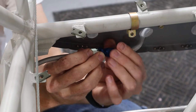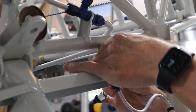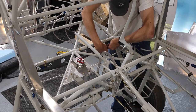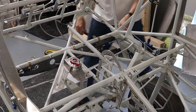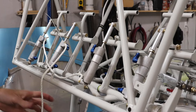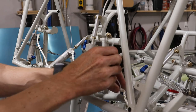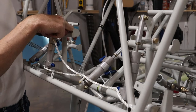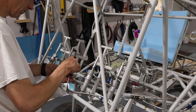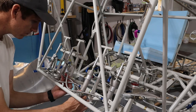To accommodate the movement of the landing gear, flexible lines are needed at the pivot point. So I attached the rigid lines in the gear legs to the rigid lines coming from the parking brake valve with short flexible lines. Flexible lines are also needed at the brake cylinders since they move with the rudder pedals. I used some rope to estimate how long the flex lines would need to be to allow the rudder pedals to move freely. Then I ordered pre-made Aeroquip braided stainless steel flex lines that were pressure tested to 4,000 psi.